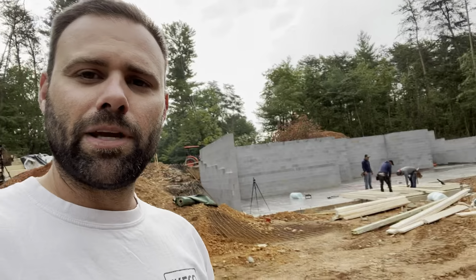So that would have been a huge problem, because our garage door that's 8 feet tall wouldn't have fit, because you have to have room for your motor and your track and all that. You need about 10, 12 inches of ceiling height above your garage door for your garage door motor and your track and all that good stuff. But anyway, we got that figured out. We got our floor truss redesigned back this morning. So literally less than 24 hours. That was great.